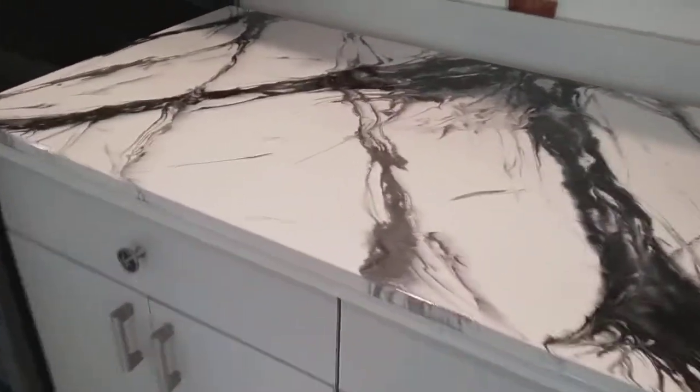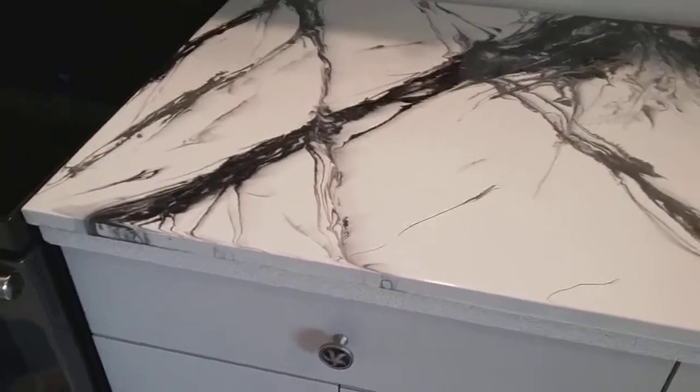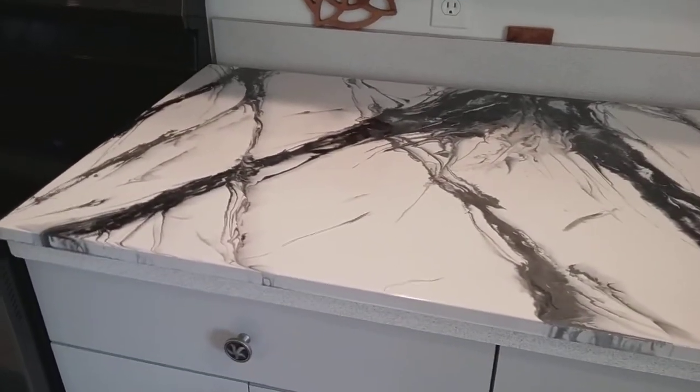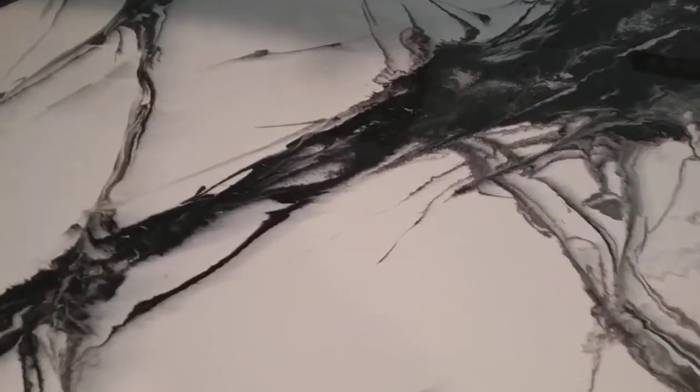So here's what I learned. I'll give you a couple quick tips that I learned as a first timer. Mike's right. You can do it. I think it's totally a do-it-yourselfer product, and it is very friendly. Okay, use of the alcohol when you're spraying it on. Use it early in the process because it doesn't seem to have as much effect once it starts to cure a little bit. So I would use it in the first 5 minutes.